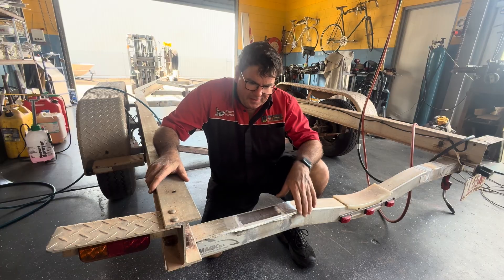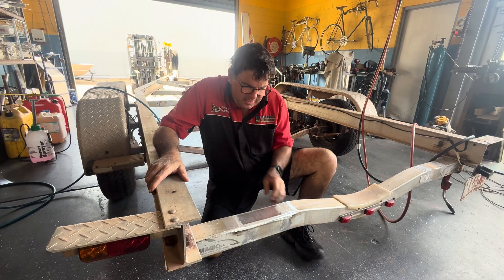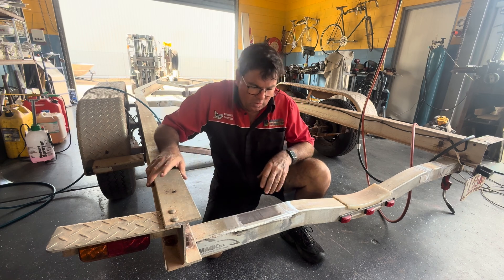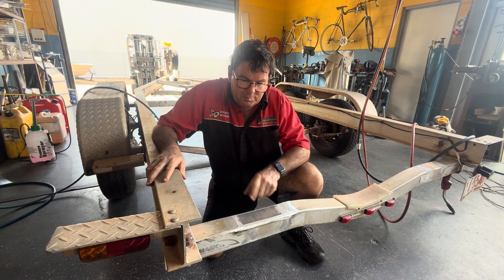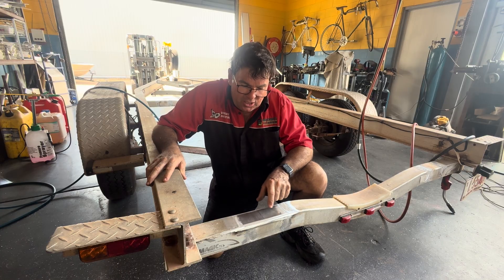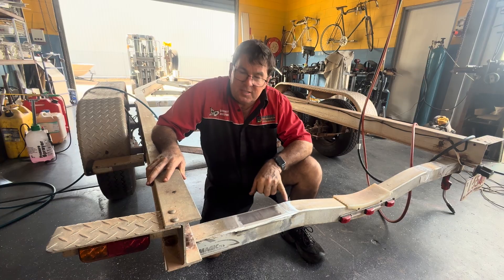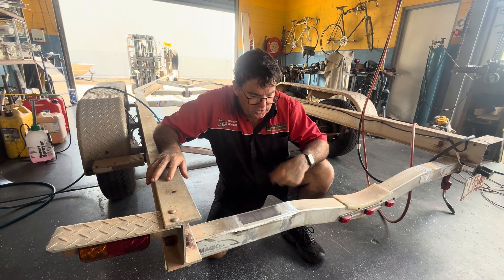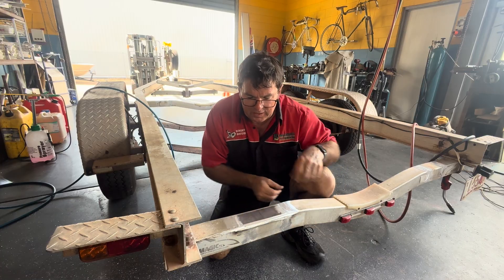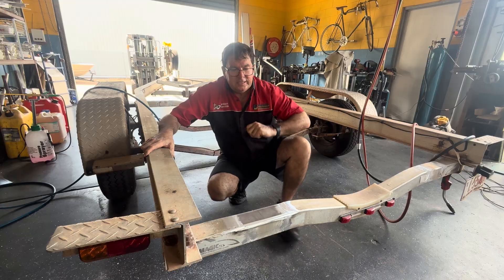I'm not going to bore you with another three of these to go, but that turned out pretty neat. And I think that's all that's required. Instead of it being a 4mm trailer now, we've gone with a bit of 6mm — and it was actually checker plate. 6mm thick is just plenty enough. Plenty of penetration through these here and welding in the corners there. That's just one repair done. Easy to do.